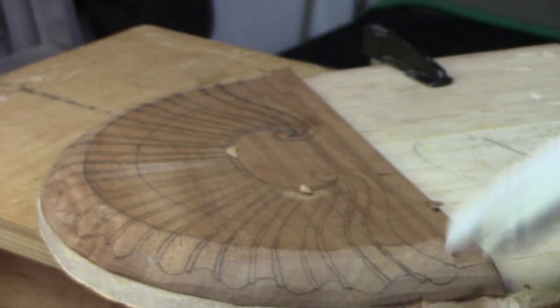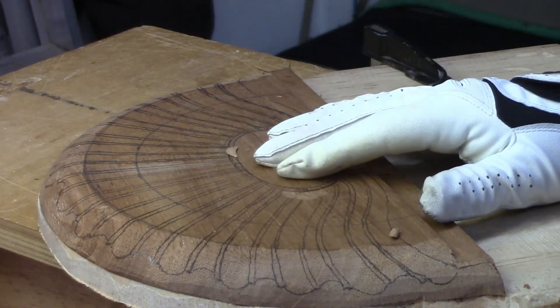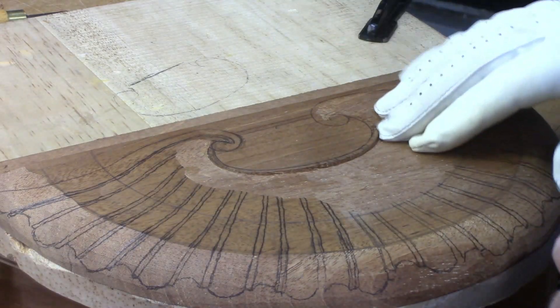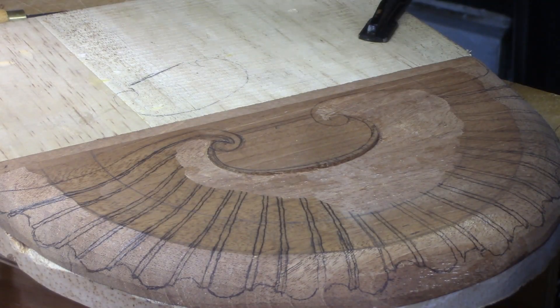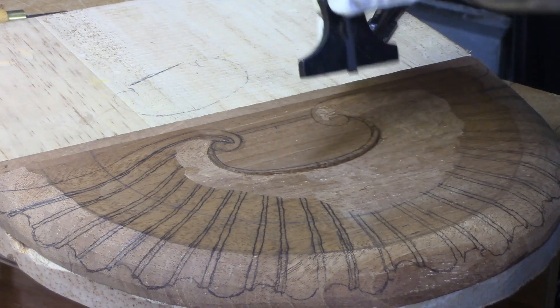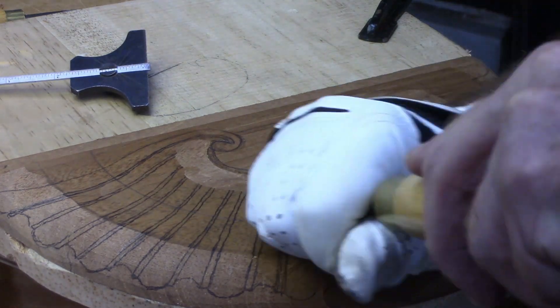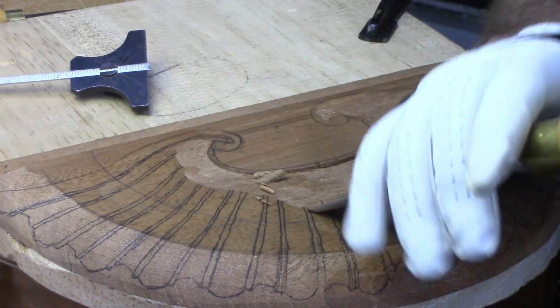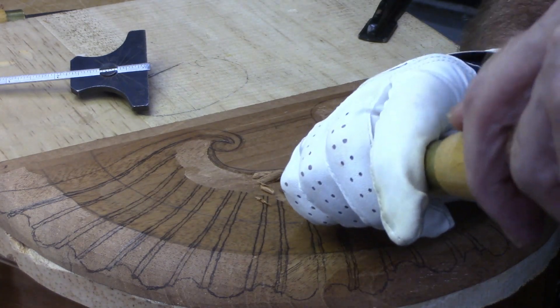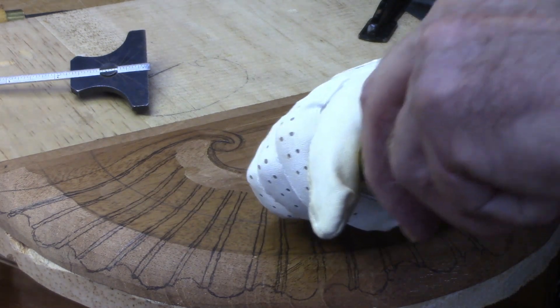Using this platform with the pine board attached, I can move it around to get at various angles. You can see how I'm starting to make my dish here. I've got a little depth gauge set to a sixteenth of an inch so I can check it along the way. Essentially I'm carving carefully down from this line, going straight across the grain at the moment to get to the appropriate depth.